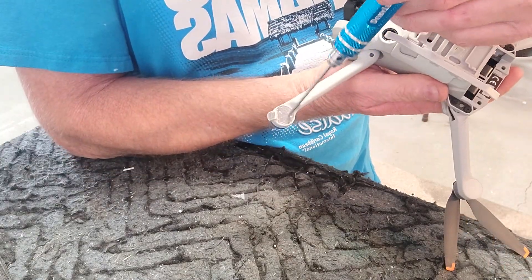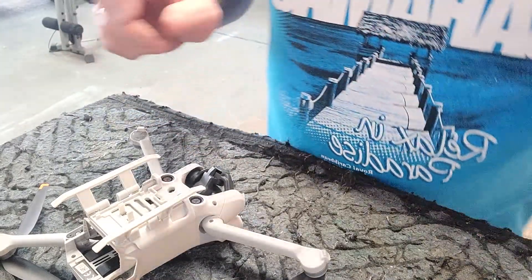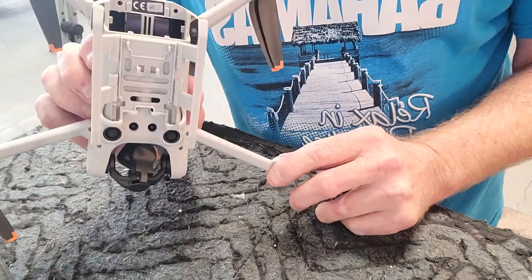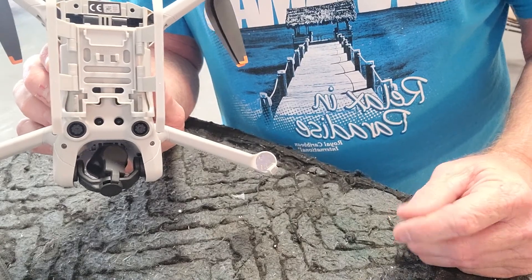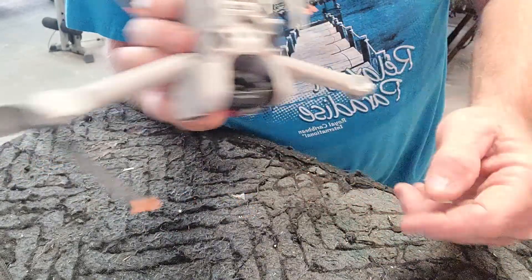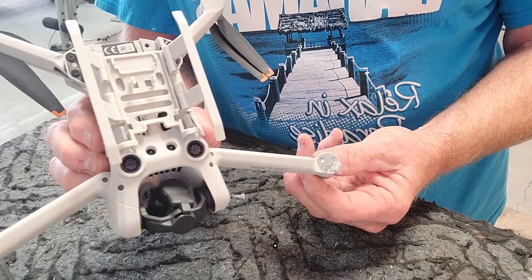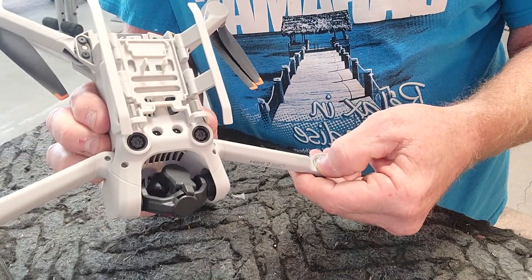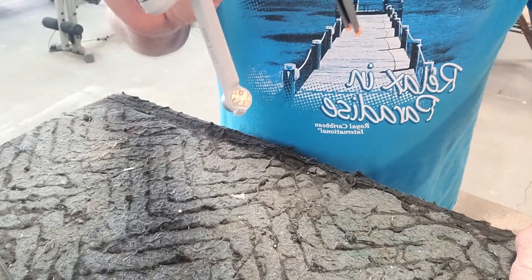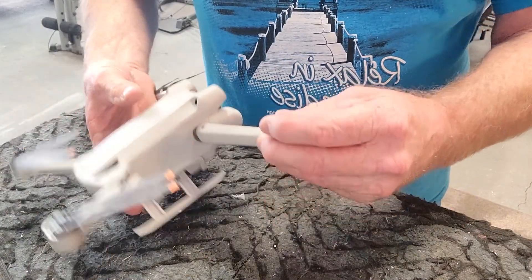I just cut a piece of vinyl to go back over it — a piece of gray or silver decal. You could just use scotch tape, anything. I do think it's important to put something back over it because those screws had an adhesive, I think from the backing of the OEM decal, and that makes sure the screws can't back out. You don't want the motor coming loose because that vibration will be a problem. It's not the prettiest but my motor does spin freely.